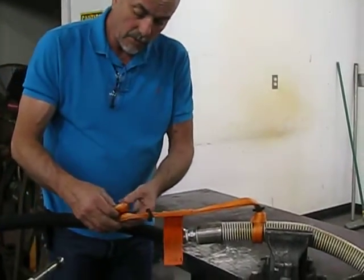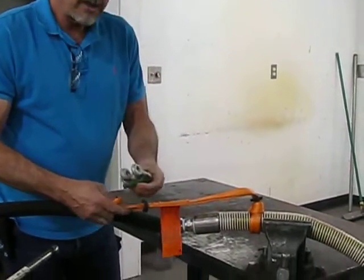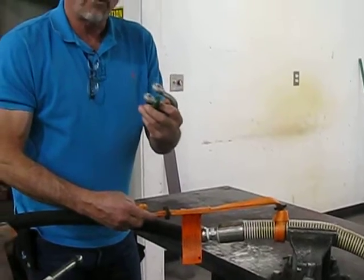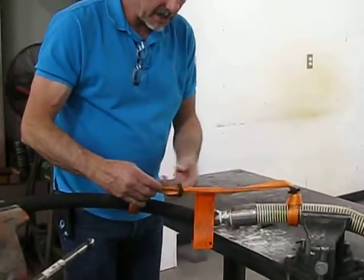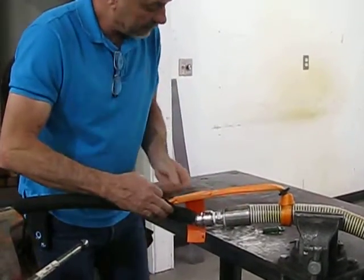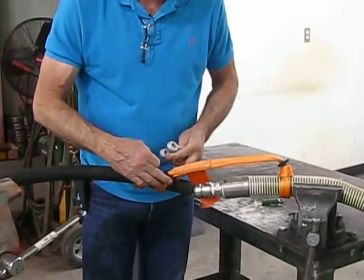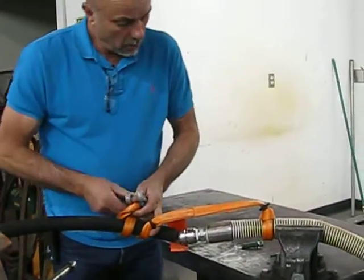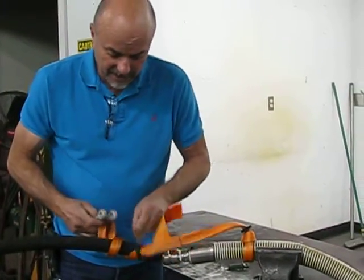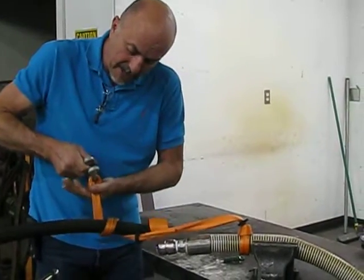On this one we want to come around and we need to use a shackle. We will probably use a screw pin shackle, a two piece, or a four piece safety shackle. What we want to do over here is run this around twice like that. If it is behind a square split flange on a hard pipe you can simply go around once. We just like to get a double wrap if it ever has a chance of sliding off. So I am going to go like this and then tighten that up — see how I am pulling that in on that shackle.